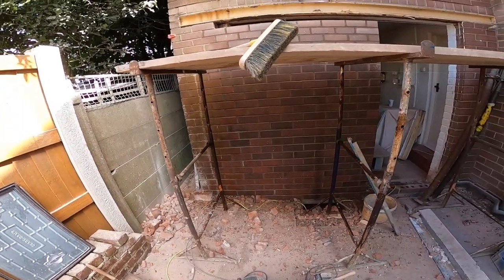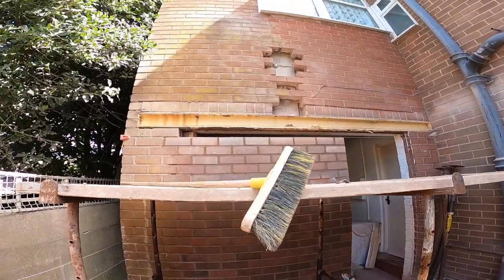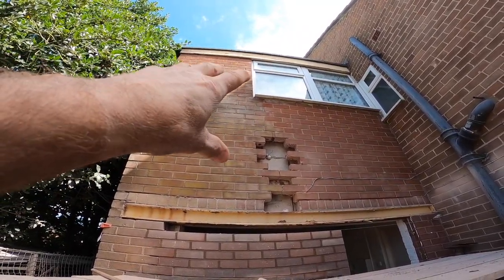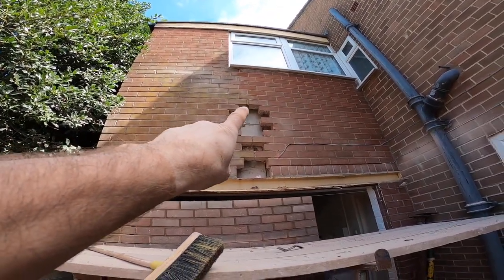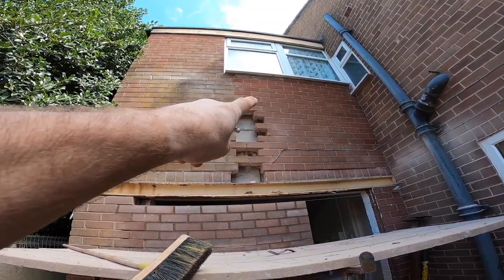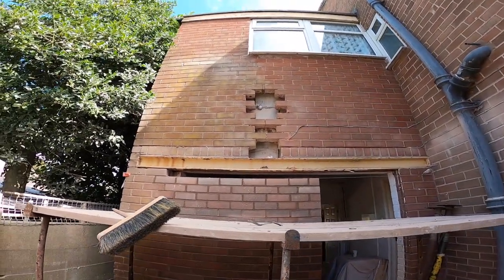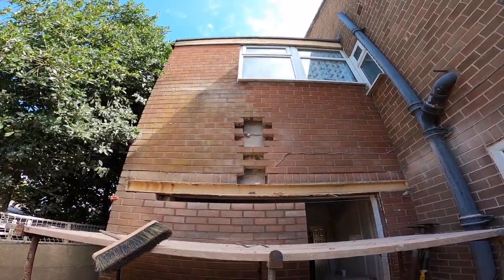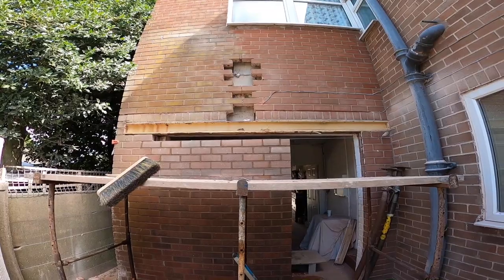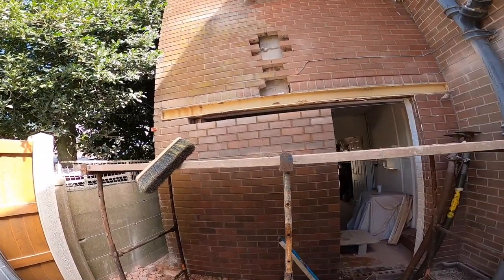Right, after lunch, quick recap time. The wheels fell off a bit this morning, late morning. I started taking bricks out. Top ones are fine, but 1, 2, 3, they've been patched up, repointed, they came out, and then I had 1, 2, 3, 4, 5 to do here. As I'm taking the cracked bricks out from the centre, the two at the side snapped. Took that one out, they snapped. Took that one out. So that's taken me longer, and it's also put us in crisis with the bricks. We need more bricks, and the bricks are from Leyland, which is an hour and a half round trip from Berries. So we know we're not going to finish today now.